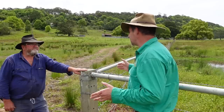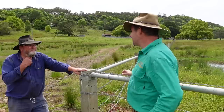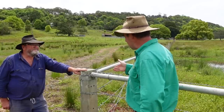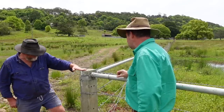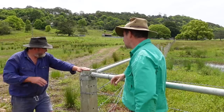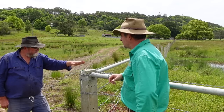So since 1948 the flood this year is two metres higher and it came up basically to your back door. You were lucky it didn't come right into the house — it was very close. You've had some large stumps move around as a result and found some things on the property you never knew you had. Lost a few water troughs and other things, and your neighbour was kind enough to return that water trough. Country hospitality. This post you originally put in by hand and only got it in about 600mm or so — because of the amount of water in the ground you couldn't dig the hole deep enough. This is an eight foot strainer and it's probably about four foot in the ground. So it moved but didn't wash away — it just leaned right over. You lost about 18 panels of little posts as a result and they only went because the strainer let them down.